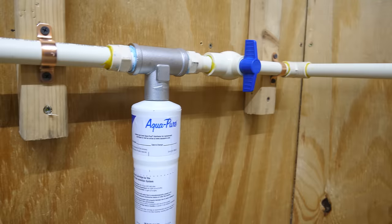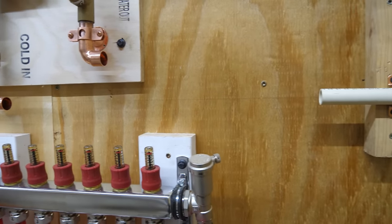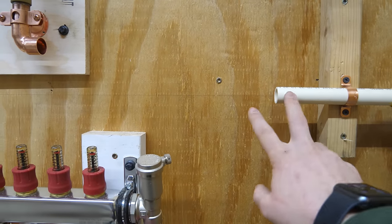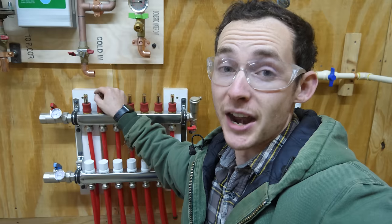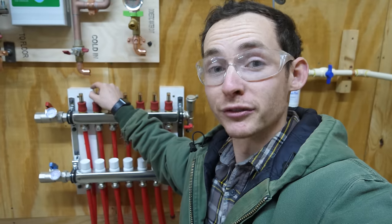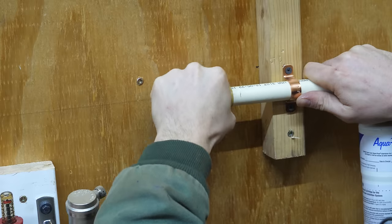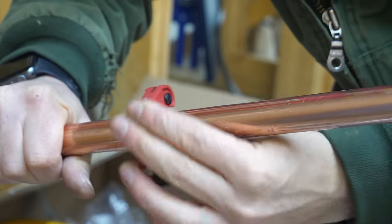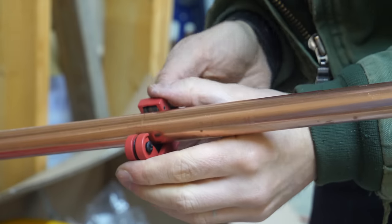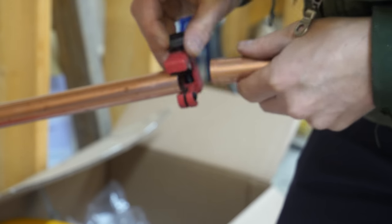Here is my descaler cartridge all mounted up. The last step is a little bit of copper to connect these two pipes. I'm going to use a SharkBite here — I know I'll probably get some flack from plumbers, but it's a really easy way to connect pipes of two different materials. Then I'm going to attempt my first ever sweat fitting on this elbow. I've never sweated or soldered a copper fitting before, but I've watched a couple YouTube videos so I think that makes me an expert. Good easy tool for cutting copper — tighten it every revolution and that little wheel slices right through it.